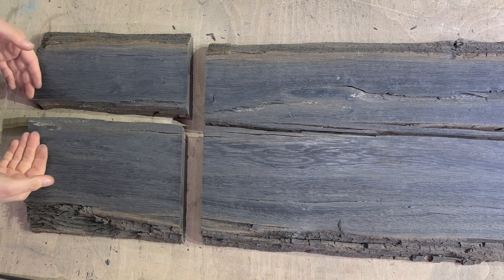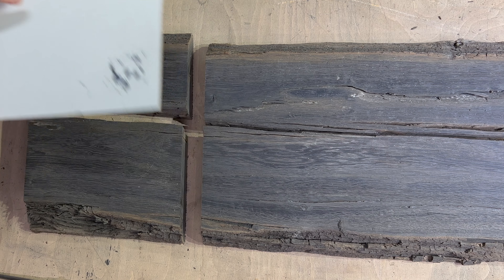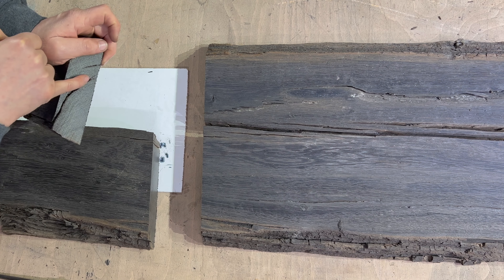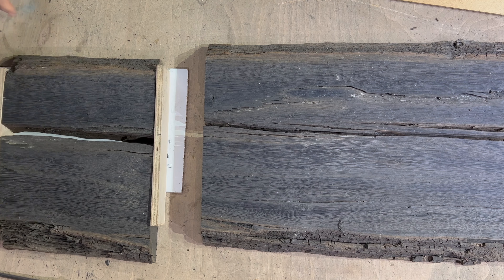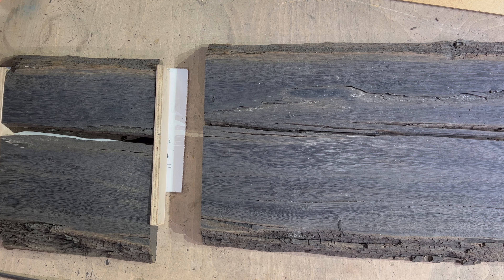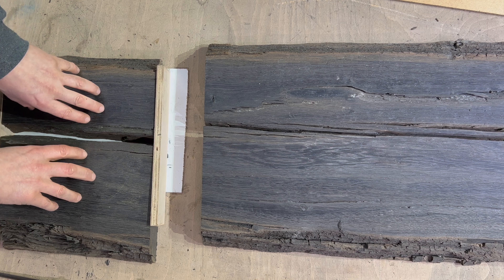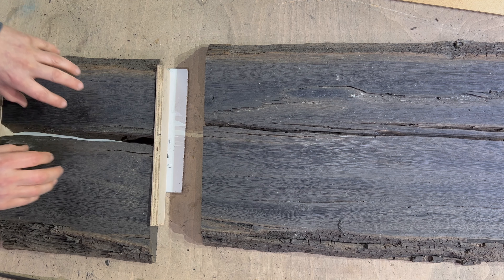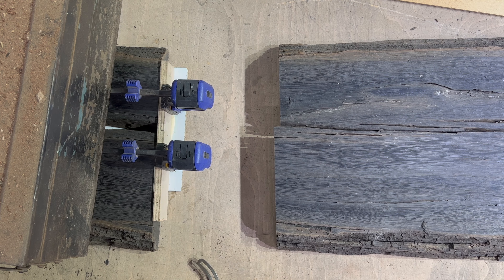That should shore up the back and shore up the ends to be able to pour my resin in there — that should do just perfect for the back. Bearing in mind the resin is going to run right down this, I'll go further over the board this way. I need to be very slightly higher than the wood because I'm really not planning on bringing the resin over the top here too much at all — I don't want it pouring over the sides. Glue those onto there, make sure I get my gap right. Now I just need to wait for that to dry.